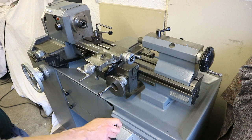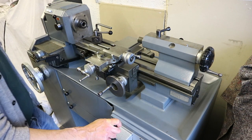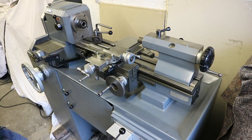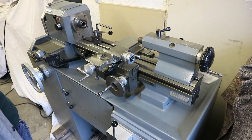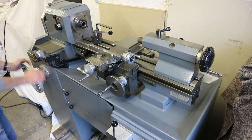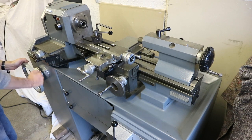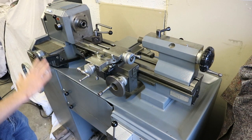So there are two speed ranges all the way through the variator range. The clutch and brake works perfectly, stopping the spindle cleanly at high speed and in the lower speed range too. Dropping back down through the lower range: about 1,000, 500, and down to the lowest speed of 270rpm — without the back gear of course.